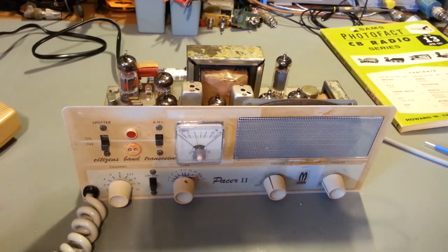Because that's why I hate squelch on CB radios. Like I say, with the exception of the newer President radios, the automatic squelch, like in that President McKinley, I absolutely love that. It doesn't care what you turn that on, it doesn't really care what the signal level is. Until there's somebody talking, it just doesn't break squelch. And the instant somebody starts talking, and it doesn't matter how far away and faded they are, the squelch kicks off. I swear, and I've had those radios torn apart, but I swear there is a little tiny man sitting inside of that radio listening, turning the squelch on and off, because it just works too well.